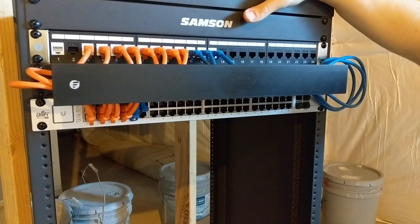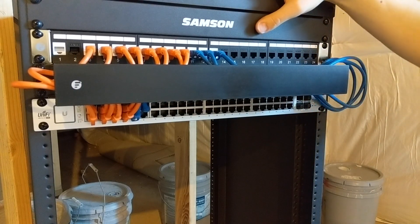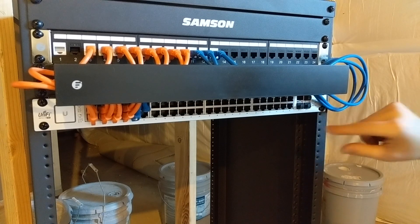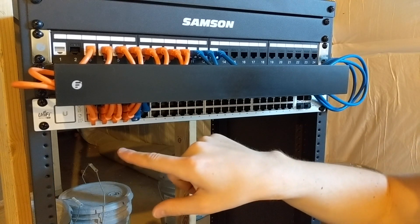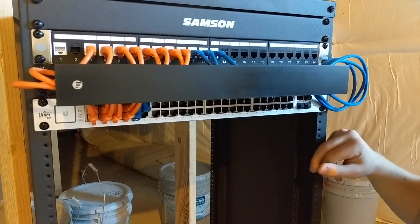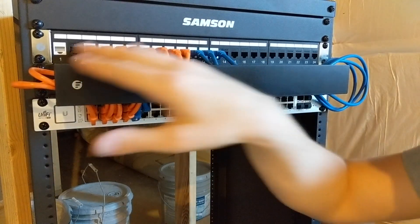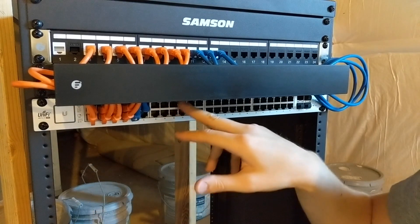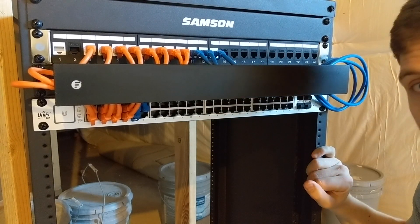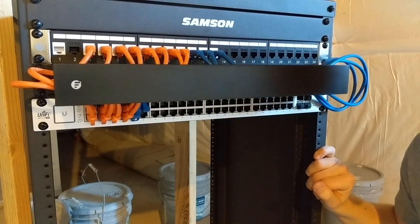These look great and they're pretty cheap too — I would seriously recommend them. The uplink is going to go from this one into here, along here, through some vertical fingers on the back of the rack, along another one, and then into the uplink on one end of the switch. On the front you only see the cables and lights — what you want to see — and everything's hidden in between. You can still read the numbers easily. Alright, that's the end of the switch install. I'm going to come back and move on to the router install, which is the USG XG-8, which hasn't been seen in the wild too much yet. See you in the next video — thanks for watching.